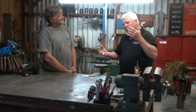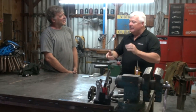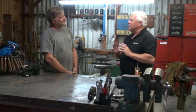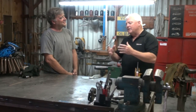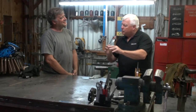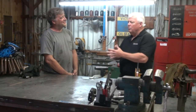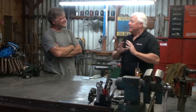You would think — but it doesn't. The CO2 is an active gas. When you're MIG welding, you pull the trigger and the wire comes out — it's live, very much like stick welding. In TIG welding, it has to be 100% inert. It can't be active at all. There can't be any volatility in there. When somebody takes that bottle and puts it on their TIG machine, they find out right away. Someone will call me and say, 'I just set up my new welding machine, I love it, torch in place, tungsten set just right, gas lens — everything set right. When I light an arc on steel, it starts a puddle and then it flares out.' And immediately I ask, 'Are they using their MIG mix?' And they go, 'What's that?' Tell me what's on the bottle — this happens every day.